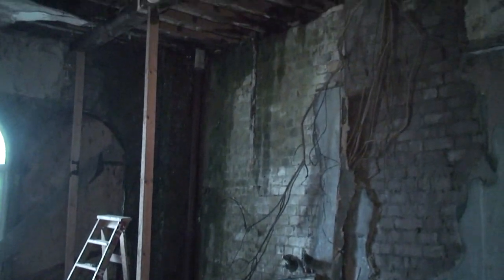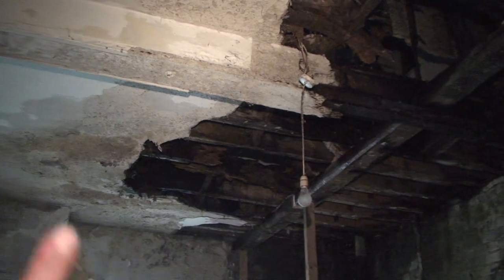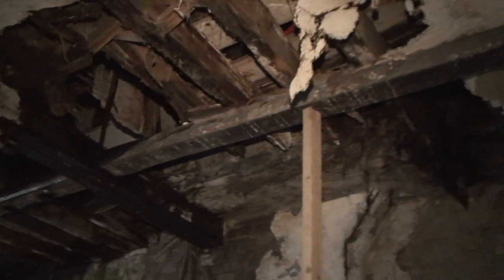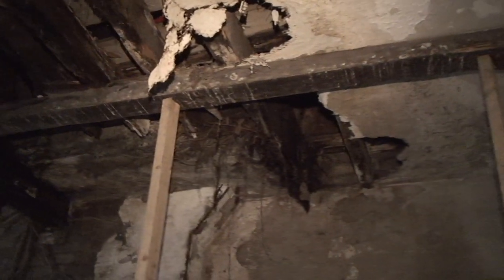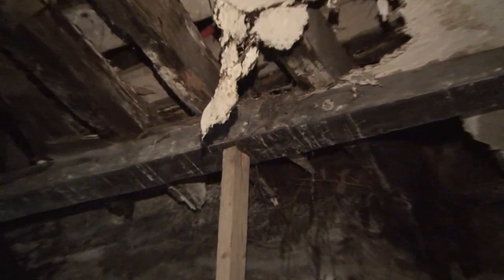This is the final floor before the roof. As you can see, there are steel beams going through and the steel beams are still quite solid. So what we've done is we've fixed the other beams up there to hold the floor up and to jack up the areas in between, because the beams up there are absolutely rotten. The joists had gone, so we've had to take the thing right across the whole side of the building to keep that area safe before we jack the roof up.